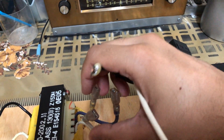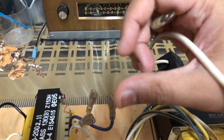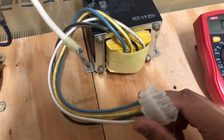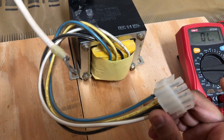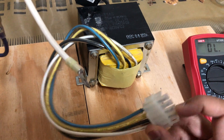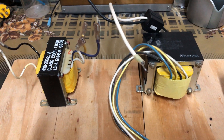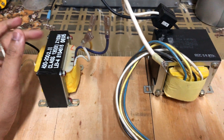I'm going to feed the 15 volts AC into the low voltage winding, and this is going to get stepped up to high voltage. You then need to use a multimeter and probe which pair of wires outputs 115 volts — usually around 115 to 120 volts. I will wire this up to the outlet and will come back.